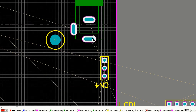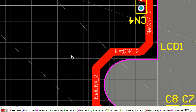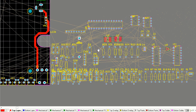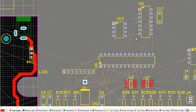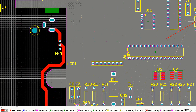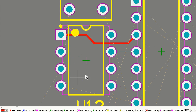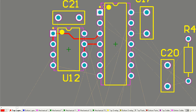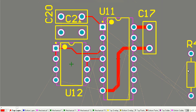And this will actually evolve as I lay out the board, because a lot of this might be dependent upon things I see when I'm laying out. So what I'm doing now is I'm placing down the power traces there, close to 100 thou wide, 80 thou, really big beefy power tracks from the DC input jack. And you'll notice all these wires connecting all the components that I've dumped down there. Altium Designer, the program, has just done this for me. It's dumped all the components down, and they're actually net wires. They're called from-tos in Altium speak. In other packages, they might be called rubber nets, rubber banded nets, highlights like that.